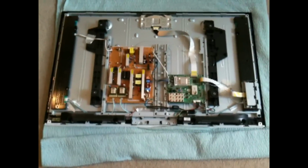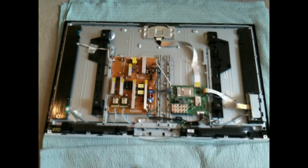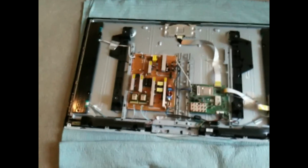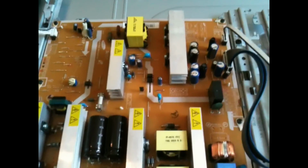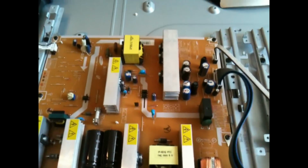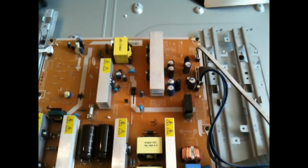And here you can see everything pretty much. And I do have 2 blown capacitors. They're not oozing the black stuff that a lot of people have said in a lot of their posts. And, I'm not sure if you can see this or not, but these 2 here are raised. And so I feel that those are the ones that need to be replaced. I looked up the information, and I have 10 voltage, 1000 UF, and 105 degrees Celsius.